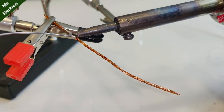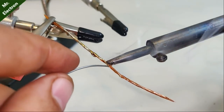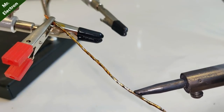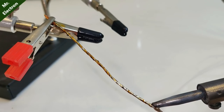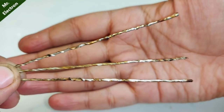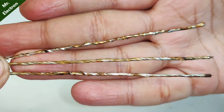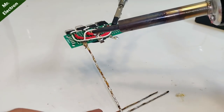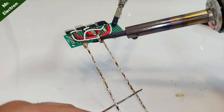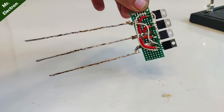Now take a multi-strand cable, cut it into three equal lengths, remove the insulation, place some flux, and solder it completely. You'll notice that when you solder it, it becomes really hard — initially the strands were easily bendable, but now they are really hard and strong. These are the three legs I've made for the big transistor and they are pretty strong. Solder all three newly made legs for the big transistor to the respective base, collector, and emitter bus bars. After completing that, it would look something like this.